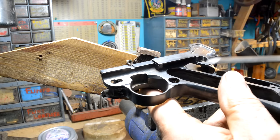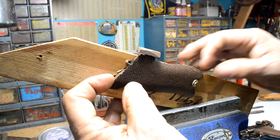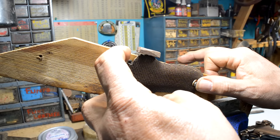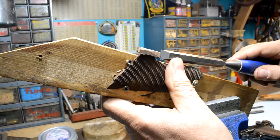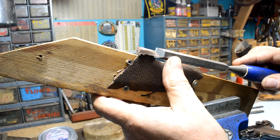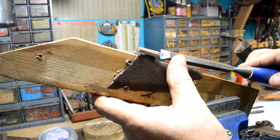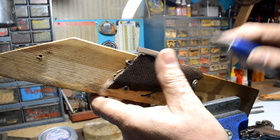There's a lot going on here. We have a complex frame contour where it stands up onto this boss in the back. We have to match the diameter of this hole. It's difficult to work on something that's this fragile without immobilizing it. I've got the bottom screw holding it down and two others just pressing into it - it's not screwed down, but it is immobilized. We have to be very careful about how much load we put on this as we're peeling this off - extremely gentle so we don't knock it off.